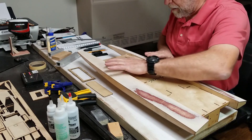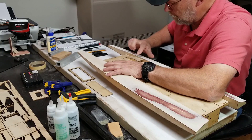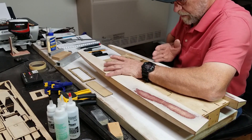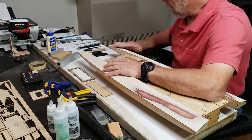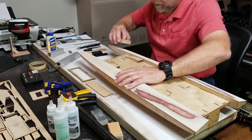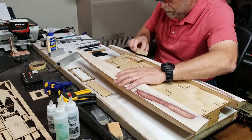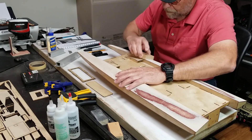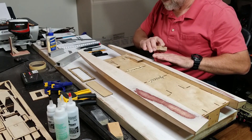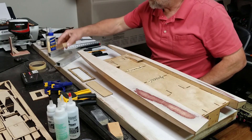Initially I'm sanding in an X pattern and holding pressure on the inside edge. I need to reduce this side by half a degree from here up into here — the rest looks the same as the other side. Then I'm taking a block so I don't get waves, pushing in certain areas and going lengthwise to level out and average that angle I've slightly changed.